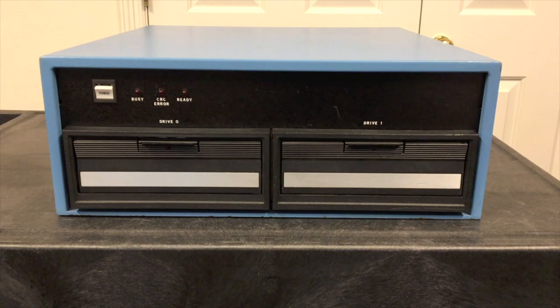And of course, once the Altair came out with the Altair Bus S100, a number of hobbyists turned to parallel interface boards and interfaced to this to get disk drives to their system. As that got more and more popular, ICOM eventually provided their own interface board to make this more of a plug-and-play solution. Otherwise, it was a fairly technical person who had to get this going, but that allowed them to just plug this interface board into the S100 Bus and get these drives up and going.